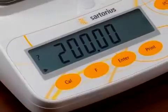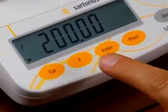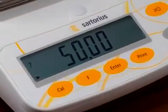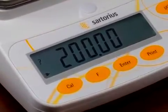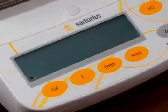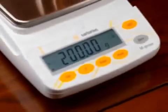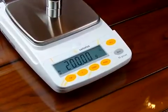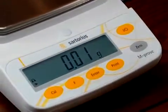The Cal button shows 200 grams — this is the default. If you wanted to, you could change the calibration weight by repeatedly pressing the F key. Press it once and you can calibrate with a 200-gram weight; press it again and you can do it with a 50-gram weight; press it again and it goes back to 200. We'll leave it at 200, the factory default. Hit the enter key. The balance says Cal and starts to flash 200. Put the 200-gram weight right in the center of the balance. The balance flashes and then reads 200 steadily — the balance has now been calibrated. Remove the weights and the balance goes back to zero.